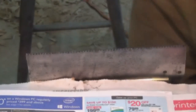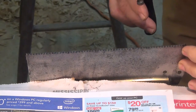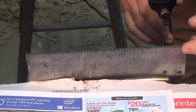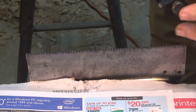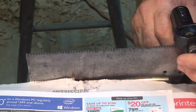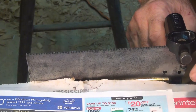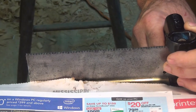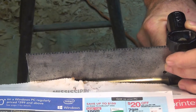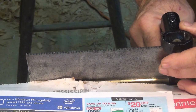Let's go ahead and set the saw. This is the back of the saw plate. As I stated previously, the saw set is designed to sit down on top of the saw plate, but starting on the first few teeth it's going to hang over into nothing, so I'll just eyeball it, keep it level, and catch every other tooth giving it just that little squeeze.